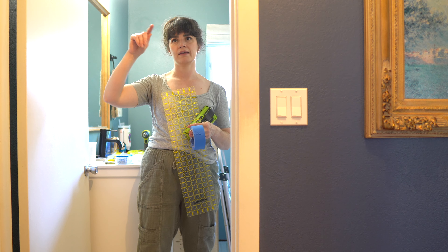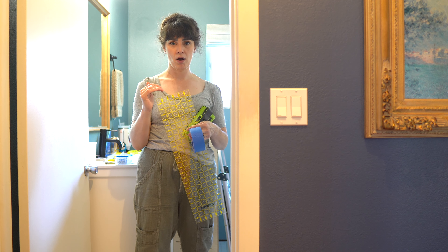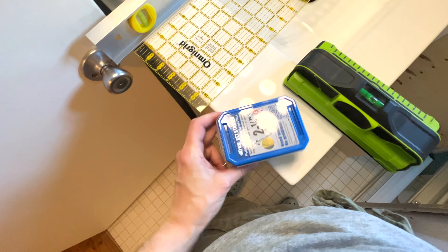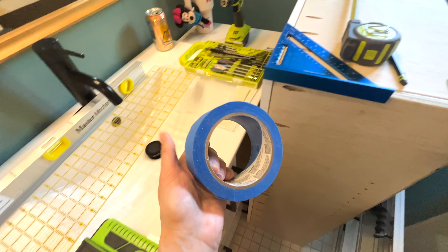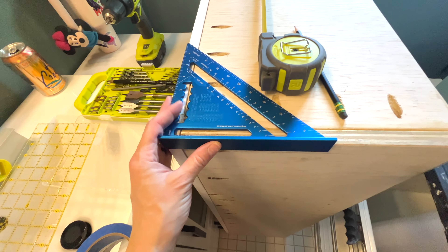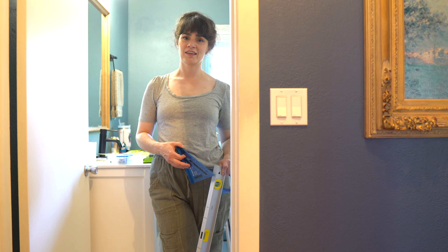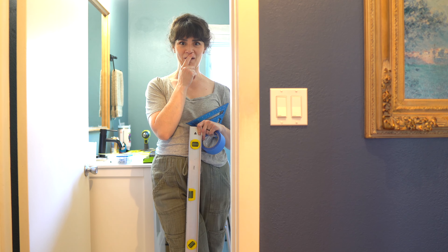I'm marking the studs with my pencil, then measuring how far in from the sides they are. I'm going to measure that exact same pattern on the back behind the support bar at the top and bottom of the cabinet. That way we can drill holes through the back of the cabinet, hold it up, and drill the screws directly from the inside of the cabinet through the pre-drilled holes into the studs — and then they should be solid. I'll be using two and a half inch screws from Kreg — three at the top, three at the bottom. You can also use painters tape to make a guide and then move it to the back of the cabinet before you drill. Having a large level is super handy, and I always like to have my square, pencil, and tape measure ready.